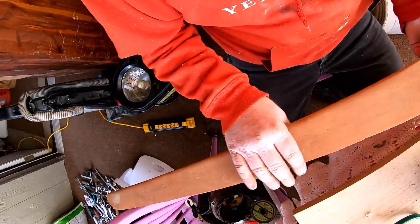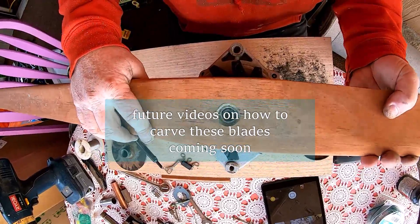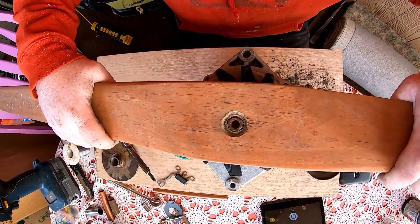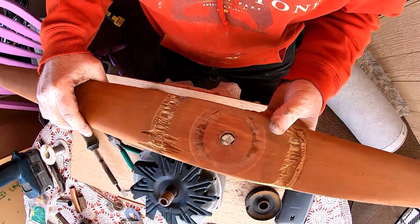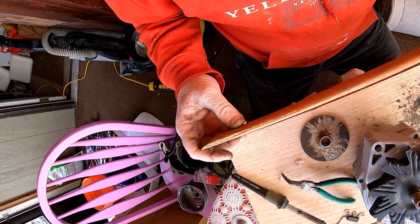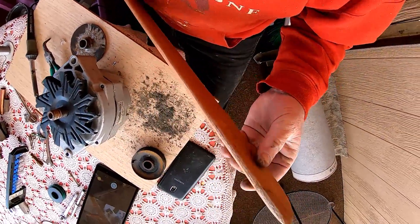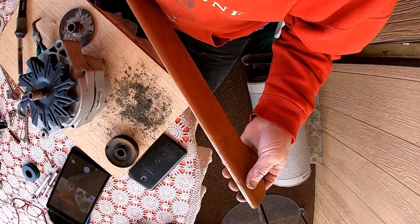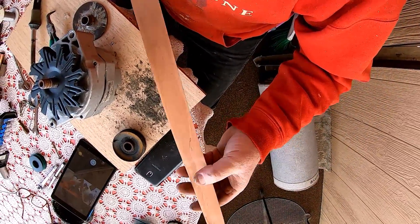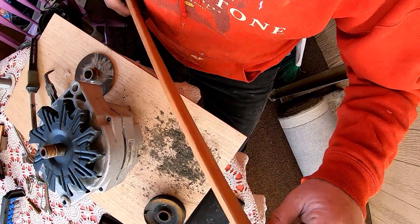We'll show you how to make one of these blades too - it's essential that you make them like this because otherwise you're just not going to get enough speed. That's a 17 millimeter hole and we suggest you buy the right size drill bit for it so you can mount your blade. That's just a little demonstration of how violent things get up there. I wanted to show you these tips - there's some slight erosion on these tips. Some of my faster wind generator blades would completely get chewed up. One way of taking care of that is to sand these out, reshape the airfoil at the tip, and get some thin CA glue to put a hardened edge on there - that'll help.